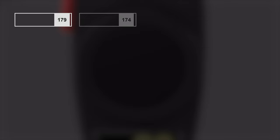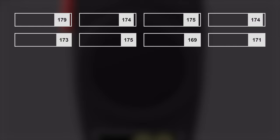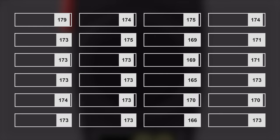On my Atari Heavy Sixer, using original Atari paddle controllers, the left paddle in port A began to register a change in the number of scan lines around 190 degrees, with 179 scan lines. It continues to charge all the way up to 320 degrees when it measures one scan line. I then tested the right paddle, then both paddles again in port B. Then did the same with the controllers that come with the Coleco Gemini, and both sets of controllers on my Light Sixer, then again on the Coleco Gemini.